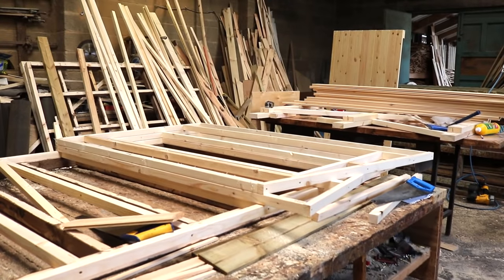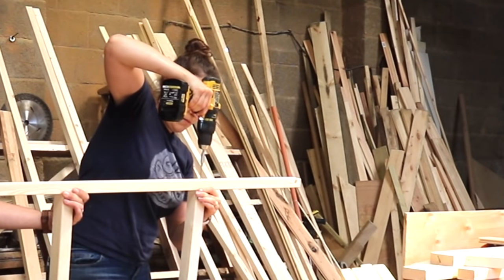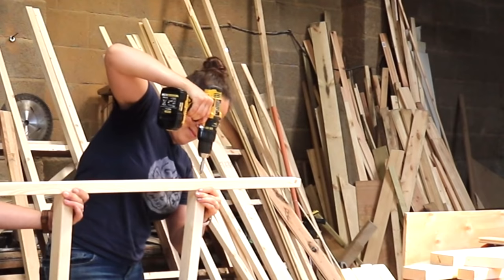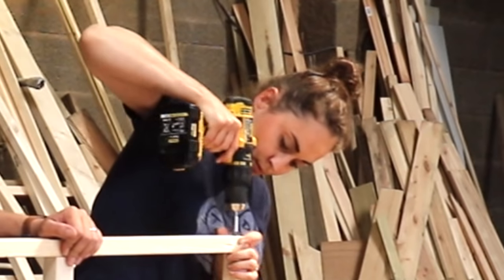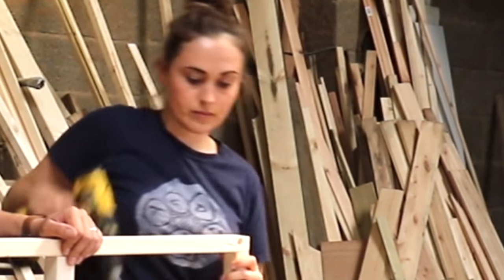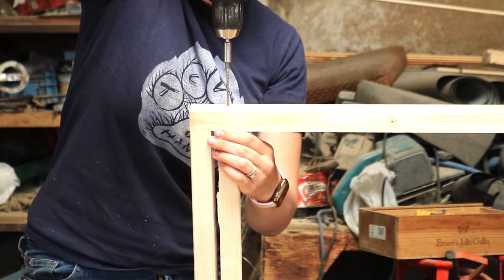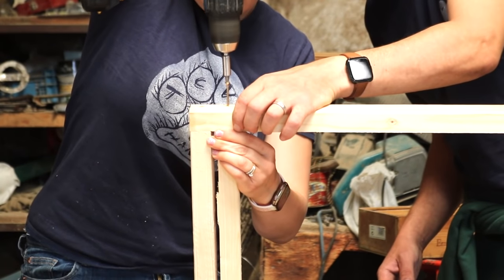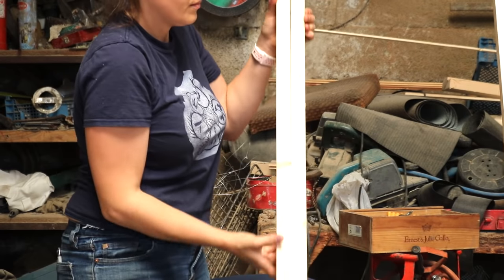It's time to build the roof's framework. Exactly the same process — screwing spars evenly between the top and bottom piece, and then another one just before the final end spars. It's this inner one that will be screwed to the shed. The outer one will create an overhang which the roof felt will be nailed to, and then a bit more trim.